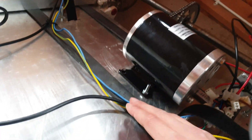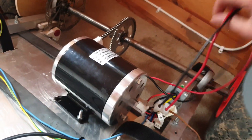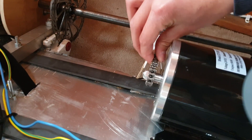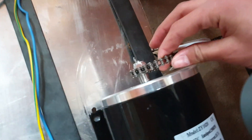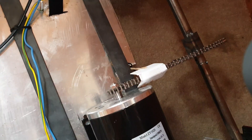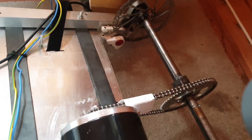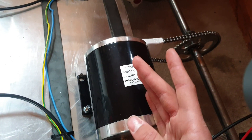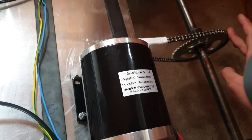So I've mounted the motor. I've drilled a couple of new holes for the bolts. I've only put two on for the moment, just to check it all works first. The wires still hang down. Unfortunately, the motor shaft was bent — not great from eBay. What that means is it will be too tight on one half and too loose on the other half. To correct that, I've had to position it so that when it's bending away, it's the perfect tightness for the chain.